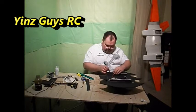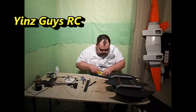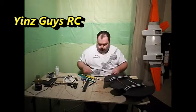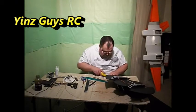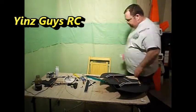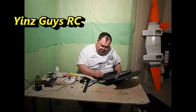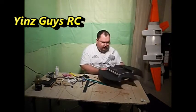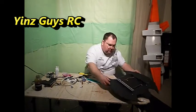The nacelles are glued on and we're going to make covers for them. We cut the nacelle covers to match the nacelle width, then cut off the width of foam on the outside so we have extra paper to fold over the top and hide all the white foam. There's a little fitting and trial and error. I also make a hinge cut so we can cover the angled portion — you just cut across and take out enough foam that you can fold it down, giving a nice-looking hinge cover with no white showing.